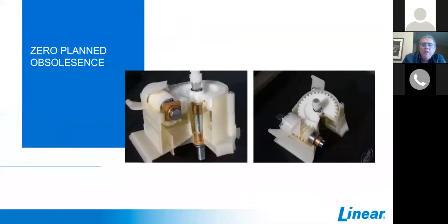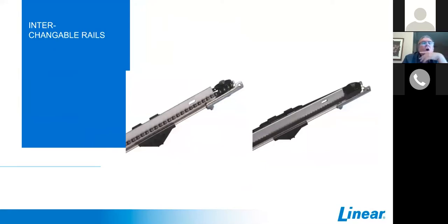So here's our value proposition on the AC. We put helical gears in all the units, and it comes with a 5-year warranty. As you can see, there's brass top, bottom, up, down, sideways, and it's encased, somewhat closed. The limit switches go on top of this. It's very well lubricated, and again, it comes with a 5-year warranty. All of my openers have interchangeable rails, from 7-foot to 14-foot in chain on the left, and 7-foot to 10-foot belts on the right.